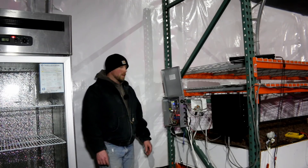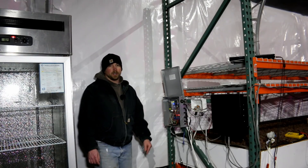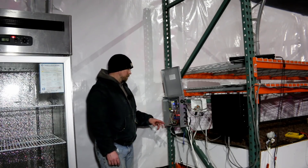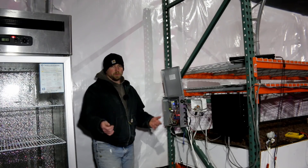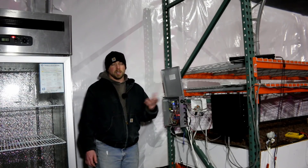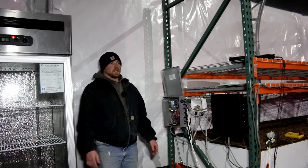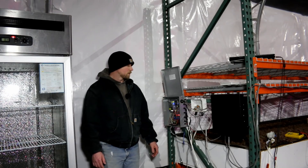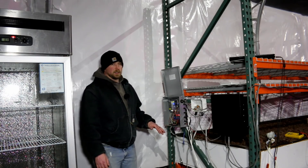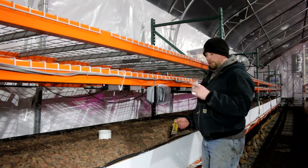After kept digging, it turned out to be a faulty ground wire created by a faulty connection — caused by some poor soldering by yours truly on the custom distribution board inside here. I also used standard connectors, and a few of the wires had come loose. Got them all set up again, made sure they were nice and tight, and sure enough everything has been working great since.